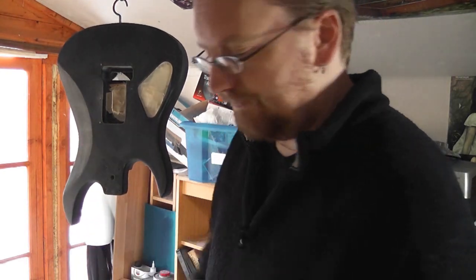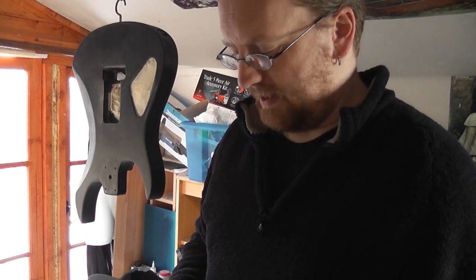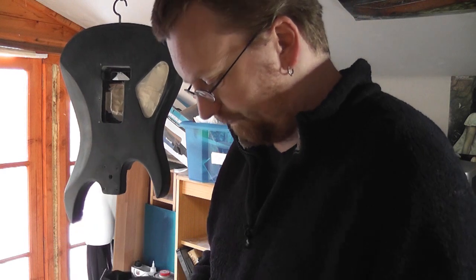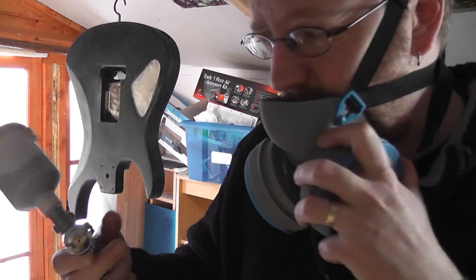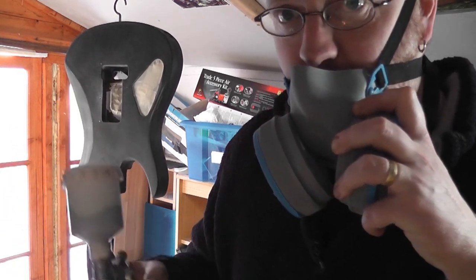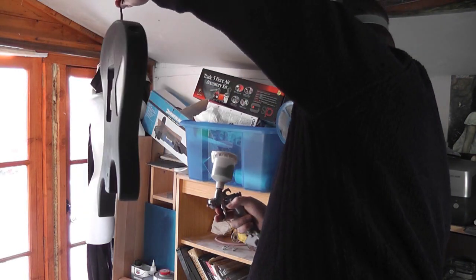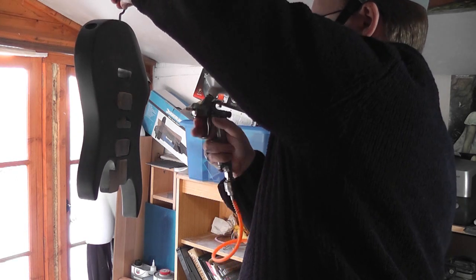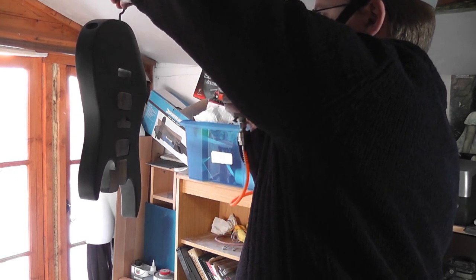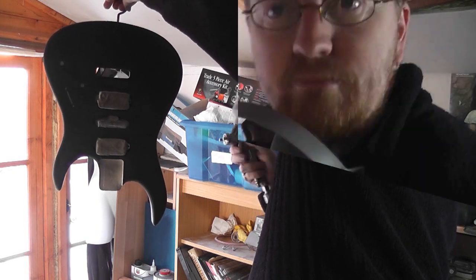Just to make sure we've got a nice uniform black surface. That's nice and ready to take the gold — I'm going to spray all over this. First and foremost, I'm going to be putting a lot of paint into the air, so put a mask on. We've got a little HVLP gun here with a 0.8 nozzle. So we'll just spray that black.